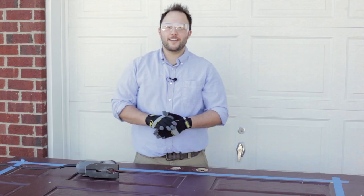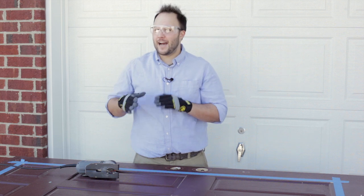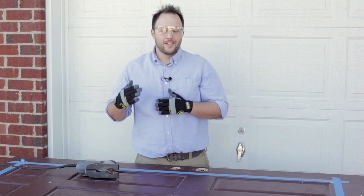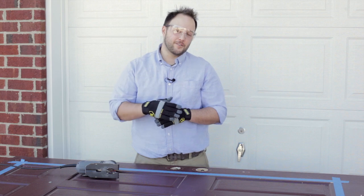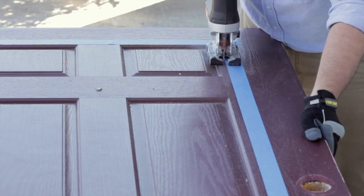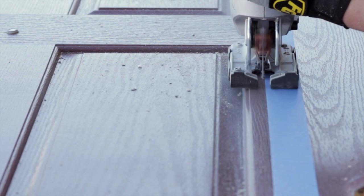Here's a tip: when you get ready to cut your door, don't try to cut through the entire door at one time. The upstroke of your blade shouldn't leave the door, nor should it go more than one inch into the door. Using one of the starter holes, insert the jigsaw into the door and cut along the mark guidelines from corner to corner.